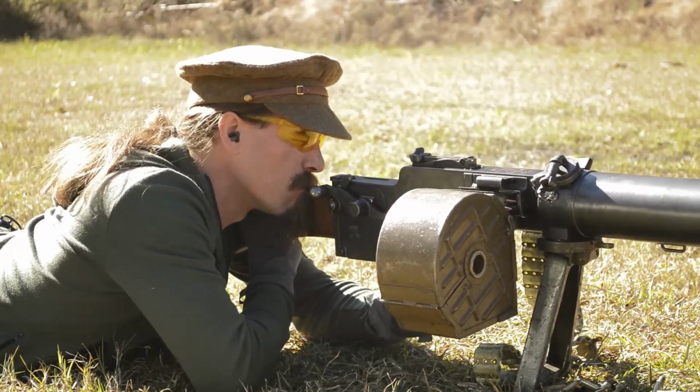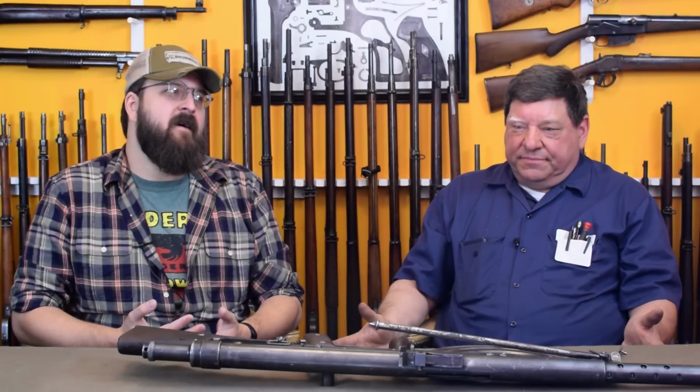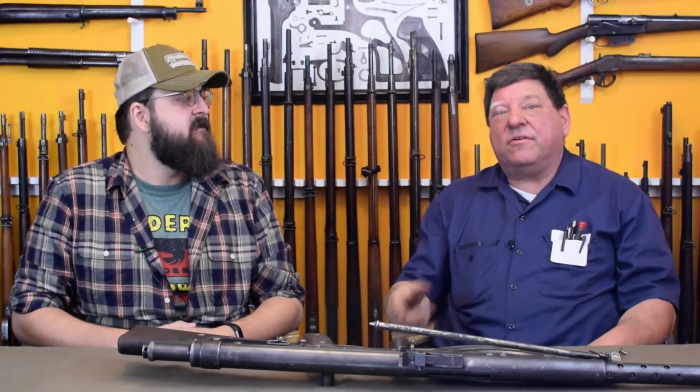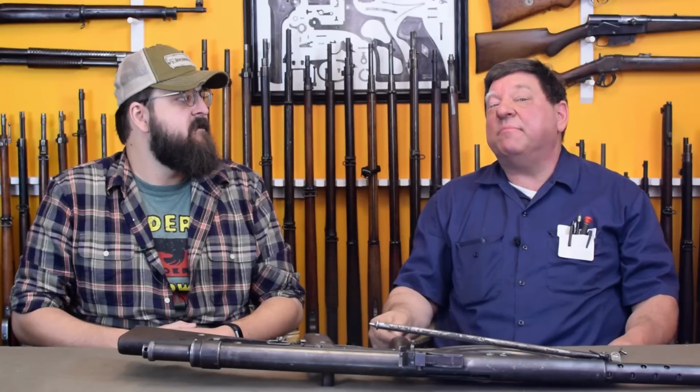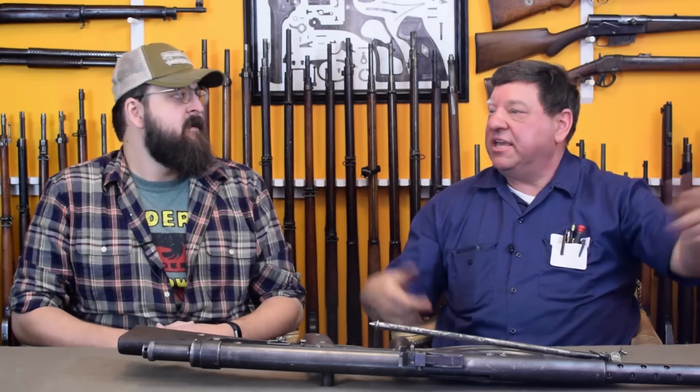We get so much trouble for that, but the problem is nobody makes asbestos rings. I went on 08 groups and got advice, and we tried out some of the stuff that was recommended, and it worked for a little while, but 3 days of sustained in and out is going to start. At the end of the day, it really doesn't matter. Those guns are not water cooled. They're steam cooled. As long as there is water in physical proximity to the tube of the barrel, it doesn't matter how many orifices it's leaking out. As long as the jacket's full, the gun will run. It's one of the testaments to Mr. Maxim's design that it did. So it's kind of irrelevant.